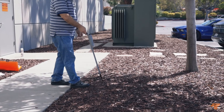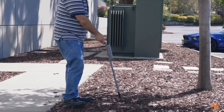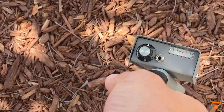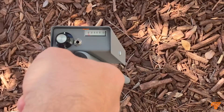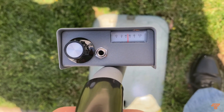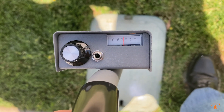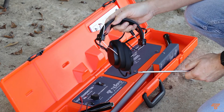The search coil of the 521A is relatively unique for a cable locator in that it is held vertically. When approaching the cable being located, the signal level will rise progressively until you are directly over the cable, where there will be a very distinct null. While approaching a typical solenoid controlled valve where the solenoid is also vertical, there will be a huge peak in signal. The receiver also has a signal level indicating meter, which can help when working in a noisy area where the speaker cannot be heard well and the headset isn't an option.